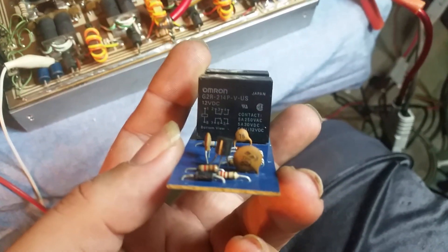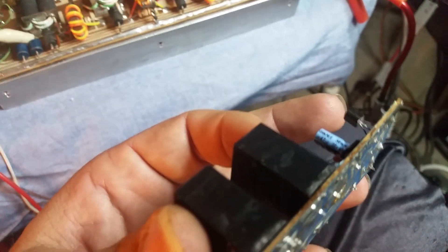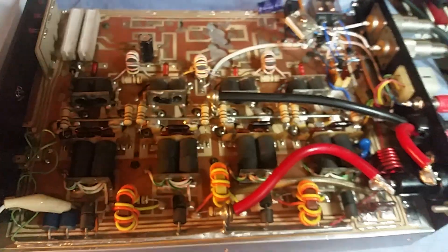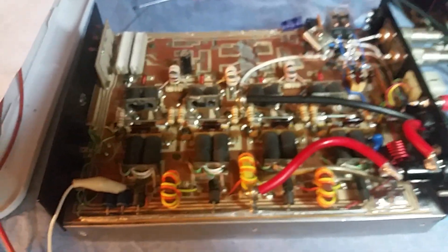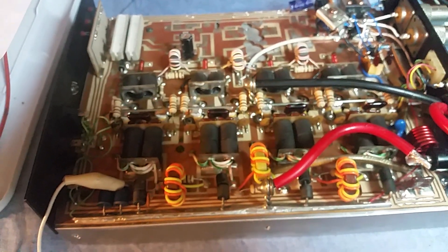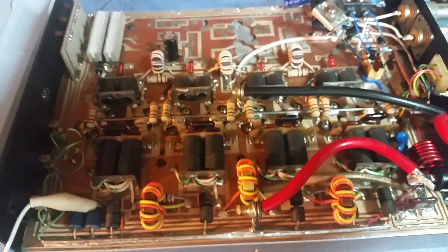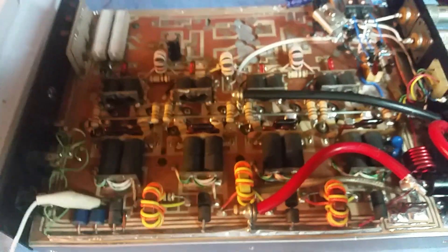Sorry, let me get back focused. These are five amp relays. Normally I like to use these on my one, two, and three transistor amps. Anything up from there I like to go ahead and move on to a 10 amp. We're dealing with a nine transistor amplifier here, but if you look at it as equivalent to the 2879, you're dealing with about five to five-and-a-half 2879s, because these are 60 watt MRF 455s — eight of them, one drive plus eight, which is nine total.